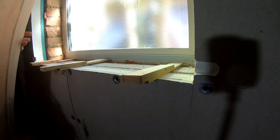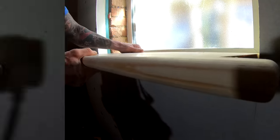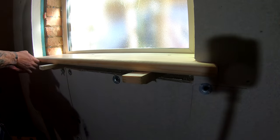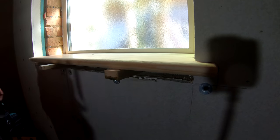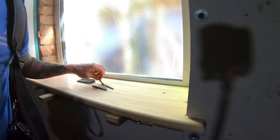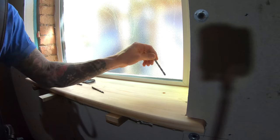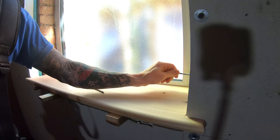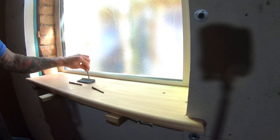I've drilled my holes for my plugs. I'm going to get this in place, move my wedge slightly out of the way, and I'm going to be using brown plugs, so I need a 7mm masonry bit for these plugs. But what I'm going to do first is drill through here with a 6mm masonry bit through this hole into the masonry — into the block work underneath — just to make a little indent, basically a pilot, in three places. I'm going to repeat that in all the fixing positions.